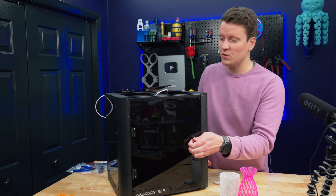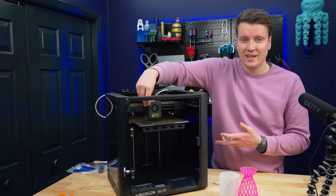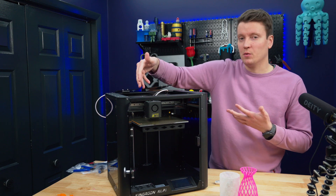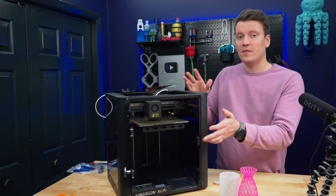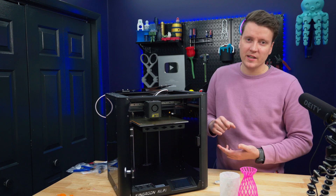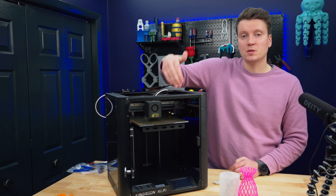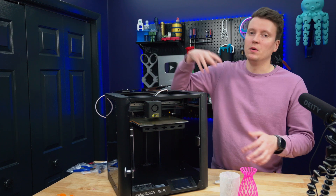There are some other odd mechanical design choices. The hot end is enclosed in a metal enclosure, which adds a lot of extra weight — extra weight on your hot end adds ringing to the print, so that's an odd choice, which is why most other printers go with a plastic enclosure. Inside the hot end, it is a ceramic heater so it heats up really quickly, which is great. It does use an inductive probe, and there are no load cells in the bed, meaning you will still need to use a piece of paper to manually set the Z offset — kind of disappointing in 2024 when a lot of new printers use load cells or nozzle probing instead.